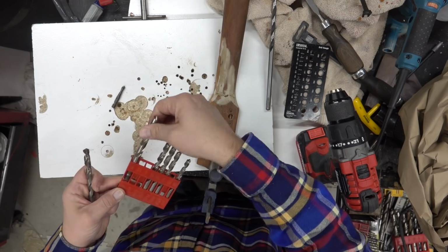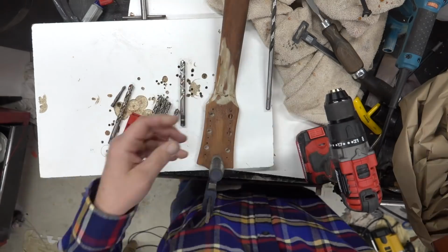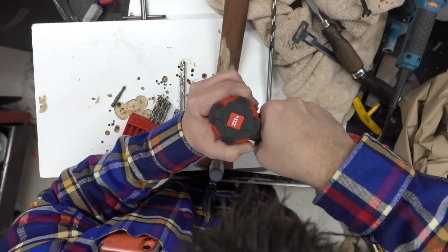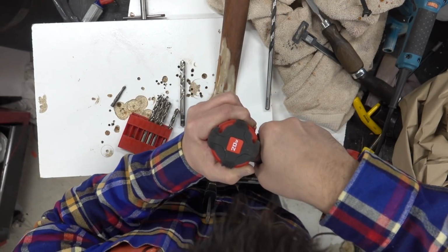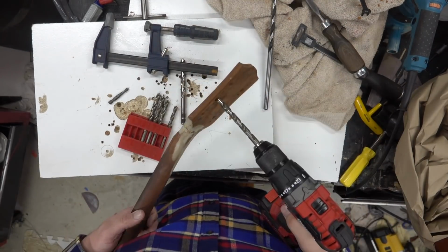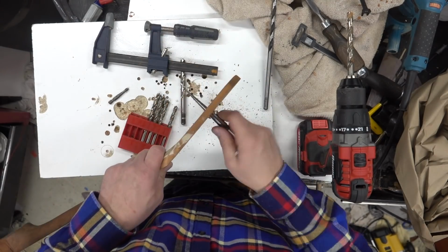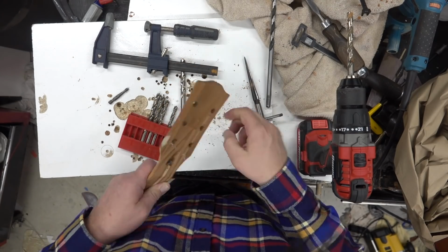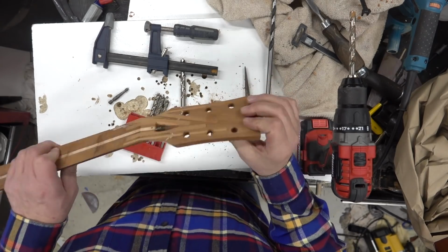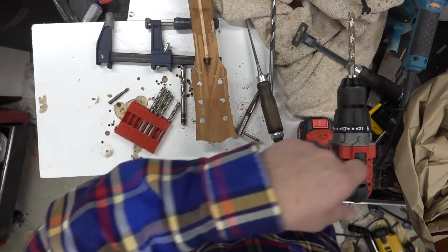So then on the back side, I have to drill out with a 3/8 inch bit, figure out the right size, where I ran one spline up through the holes. So I'm just going to actually not use the drill forward, I'm going to use it backwards and just sort of enlarge those holes slightly, running this at reverse speed, not forward speed, because then I'd just tear it out. So I'm just sort of smashing it from the backside versus drilling it back out.